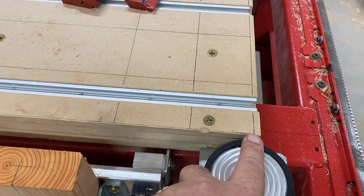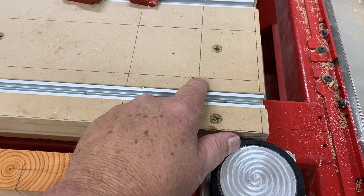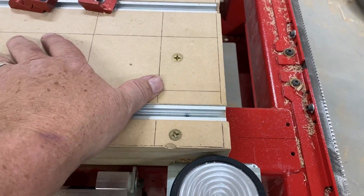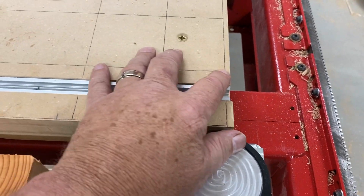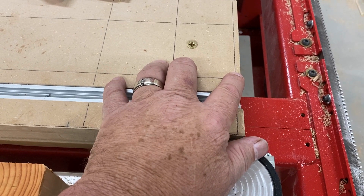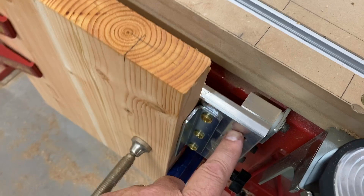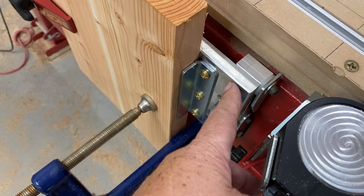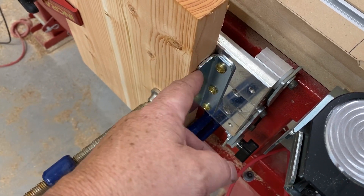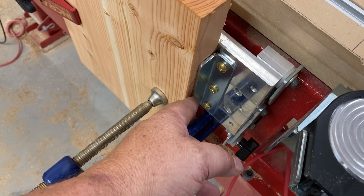That sets up the XY0 and I can set it up at 2.5 inches or 5.5 inches. I usually work off this part of the table, but you're rarely going to be putting a part on this edge here — you'll have some clamping issues, though it could be done with a workaround. Now on your vise, this face here is going to be your X0, and this is going to be your Y0.